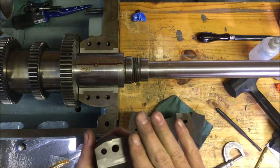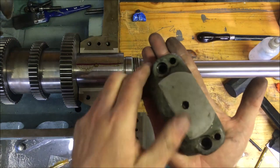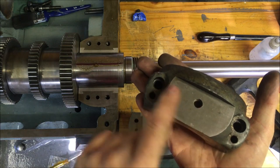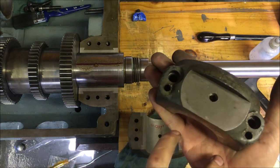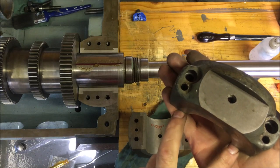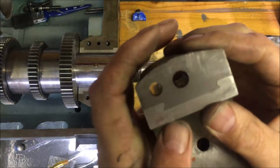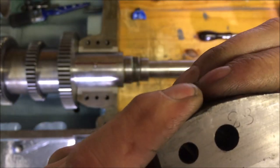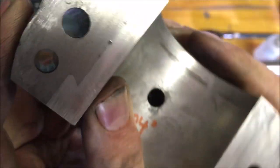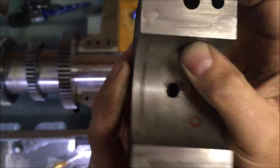and I want to dig out a surface plate and basically measure up, stick that face down and get a measurement across that and see if that's a parallel face to these two. If not, it means I've got to mess about trying to pack it so that the shaper's cutting it like that. What I did notice was if I squeeze the faces, I can get oil coming out from between them. So I've got to be mindful.